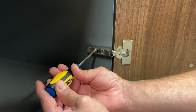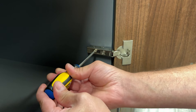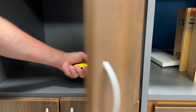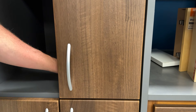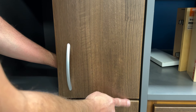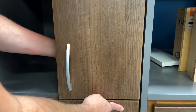Now there is the rear screw adjustment — this goes in and out. This will make the cabinet door go away from the cabinet and towards the cabinet. As I turn this, if you look right here at the bottom you'll see the door coming away from the cabinet, and then I can turn it back the other way and it will go towards the cabinet.